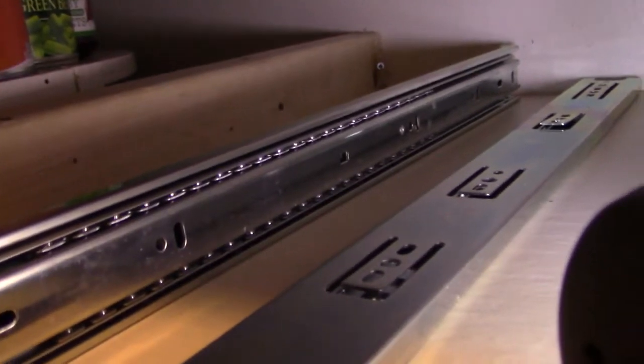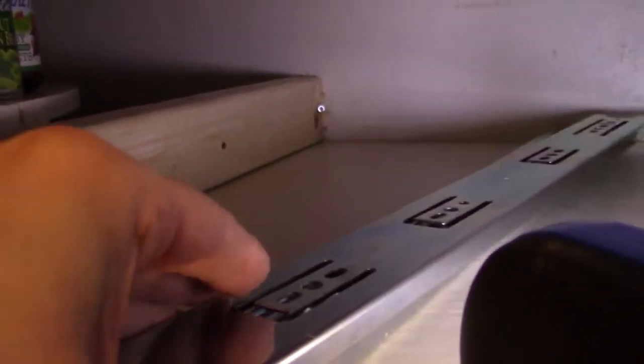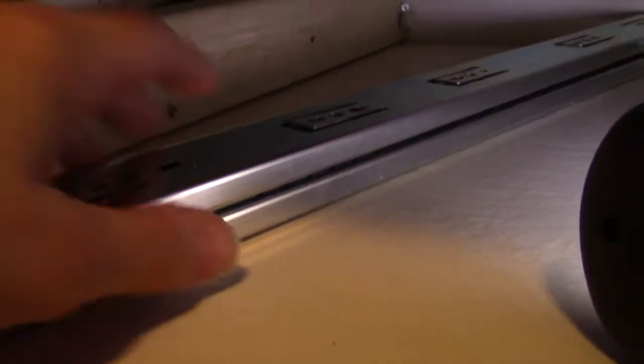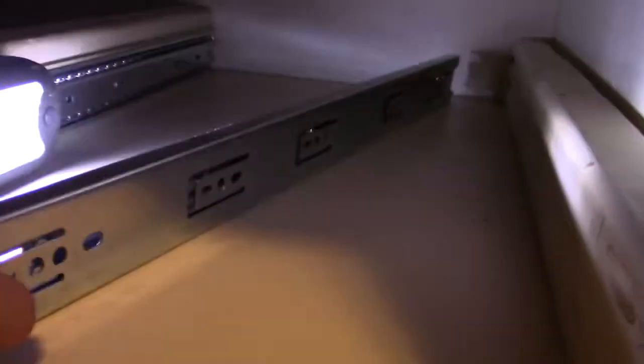And here are the two slide outs, and I know from measuring that the two of these together are 1 inch. So whenever you make your drawers, you have to take off at least 1 inch from the overall width of the drawer to get it to fit with the slides and the bump outs that I did. That thing is magnetic and it sticks to everything.